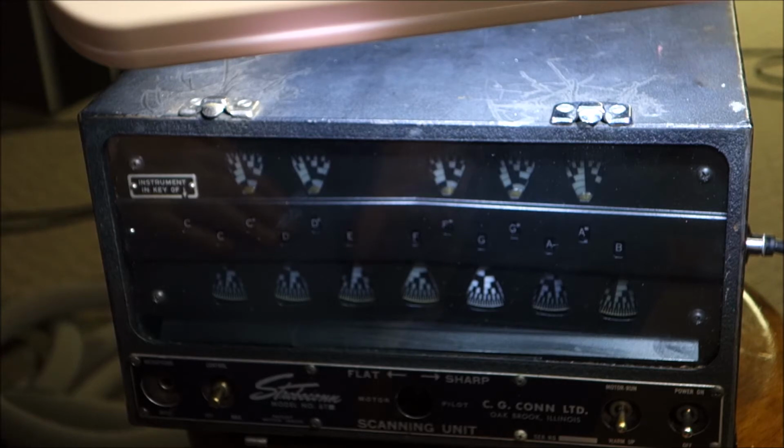As of tomorrow afternoon, I should have all of the capacitors to redo this. We are going to be doing new tubes and new capacitors throughout, which is great. In the meantime, I will start. We're going to be using the yellow tubular capacitors for the film, just because of their dimensions. They're going to be easier to put in there than the red film capacitors. And then we have new electrolytics. We're going to try to fit electrolytic capacitors beneath the chassis rather than trying to replace the giant cans, which are in short supply nowadays. So we'll get going on this, and we'll see you as we go through and change capacitors.